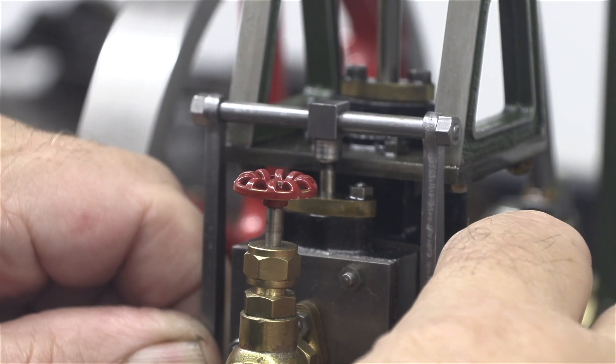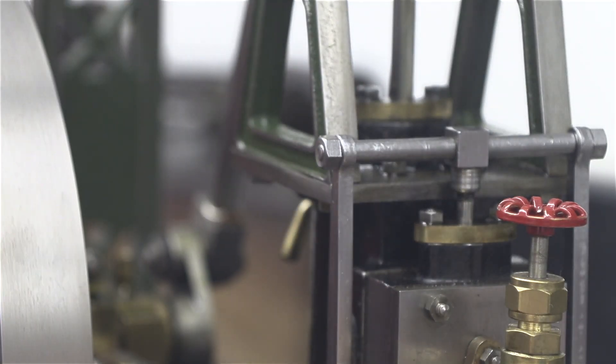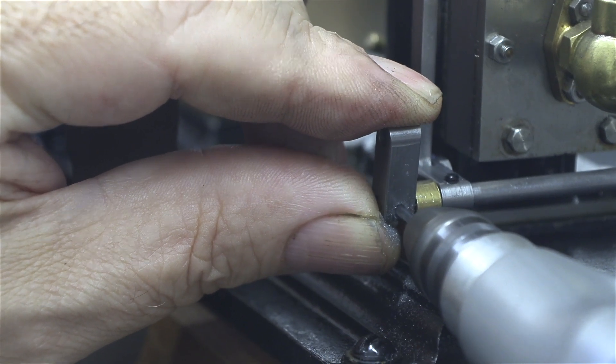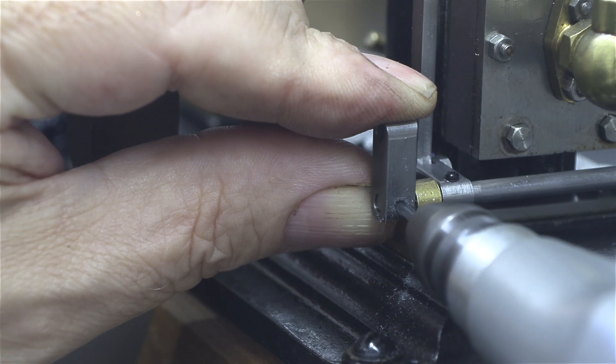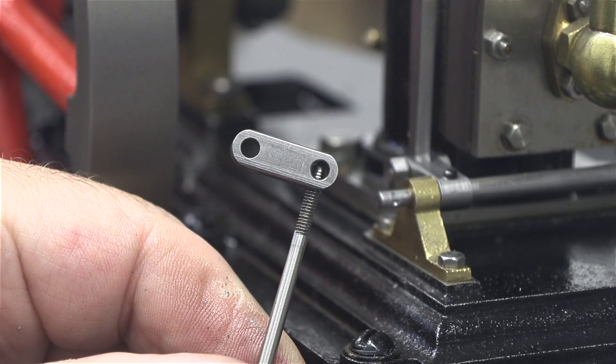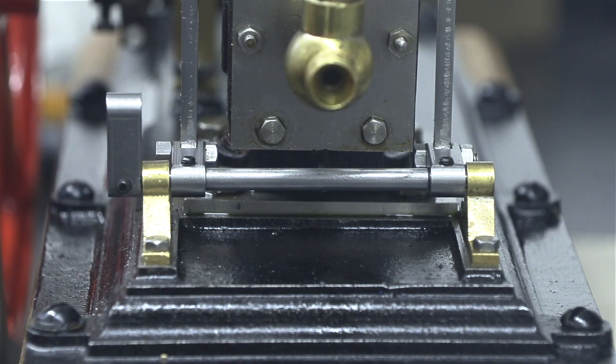In this clip I've reassembled the valve operating mechanism and it feels a whole lot better. This engine needs quite a lot more attention than I'm showing at the moment — I'll do that in a later episode. Once again I'm drilling a detent in the shaft, but this time it's at 90 degrees to the other detents. I threaded the rocking lever 6BA to accept a grub screw, ground the grub screw to a point just like all the others, and now this assembly is very strong. The upright rocking lever is in exactly the right place relative to the other two at 90 degrees.